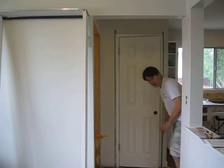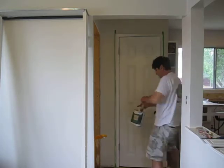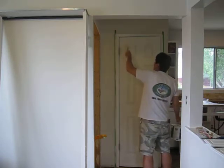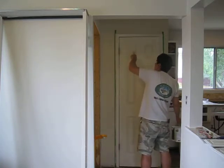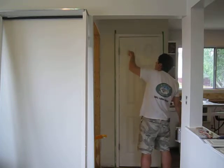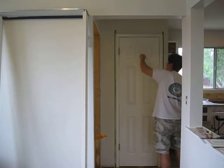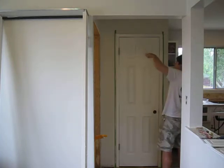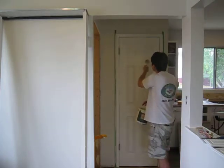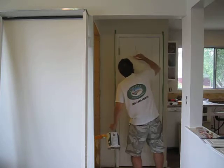There — beautiful finish. Now I'm going to come back and give the interior part a quick back brush as we call it. Because this is a white paint, it doesn't cover all that well with the brush. This will ensure two coats. And don't put it on too thick because it could run on you. Just take a look after you've done painting it — come back in a couple of minutes, see if there's any runs underneath the lower part. That's where the paint can catch, on the lower part of the mortise.